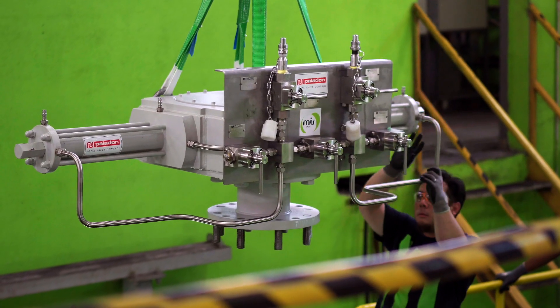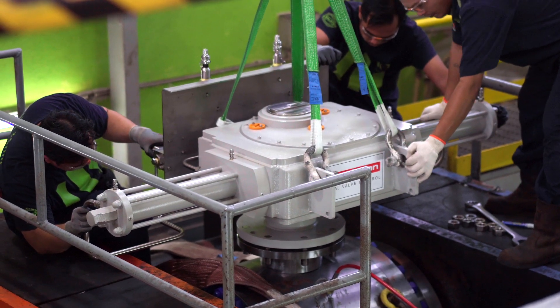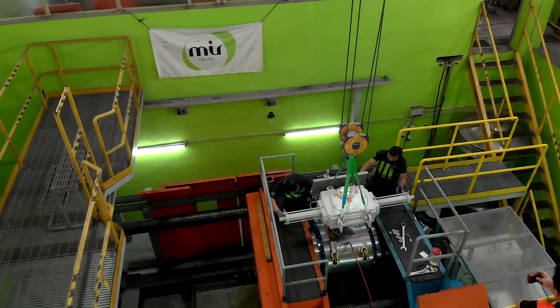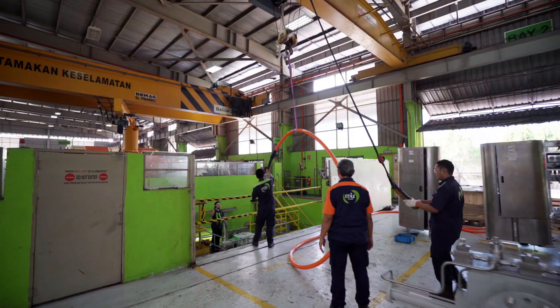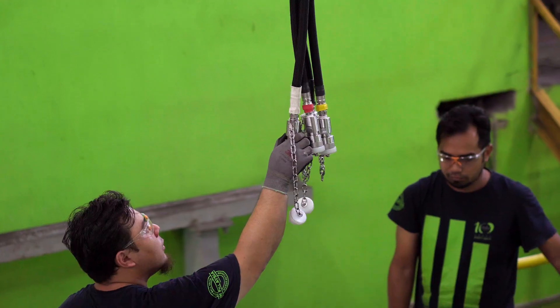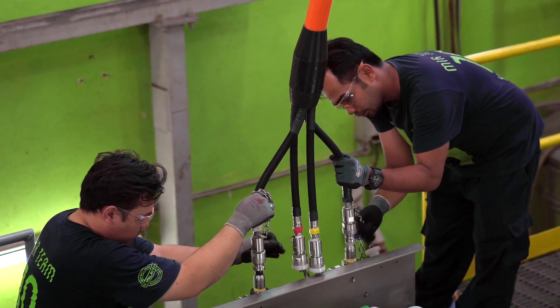The contact between seat and ball is metal to metal contact with tungsten carbide coating. The actuator is a hydraulic actuator, SSIV. The valve and actuator will be stored 30 meters below sea level and will be connected through the umbilical to the buoy, where there will be the HPU, the storage tank and the solar panel.